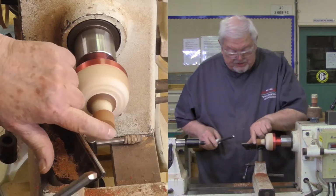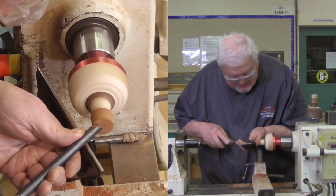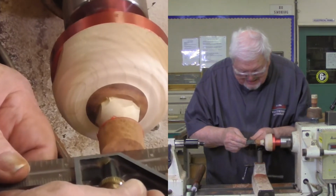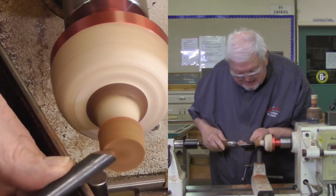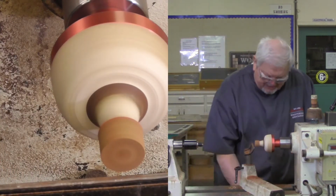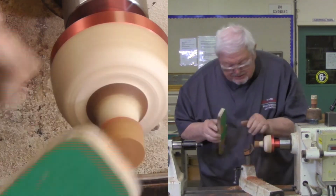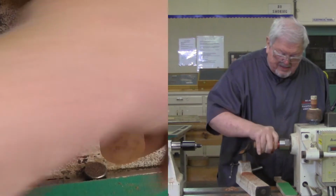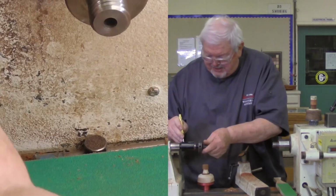Okay, while it's on the lathe, I'm going to make sure this is dead flat. It looks pretty good. Let's check it. A little high on the edge. Fine enough. Now, the sanding stick. Just enough to be sure that's dead flat. That one's ready to go. And that unscrewed fine. We'll move it over to the tailstock, which is where we'll be using it.